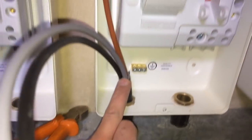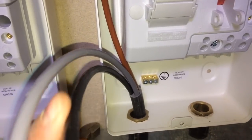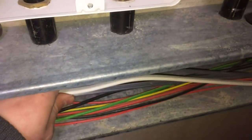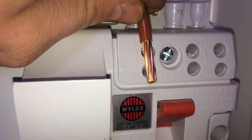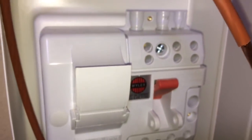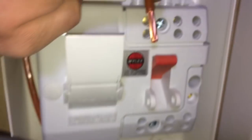The way you do that is just get your stanley knife, ring it round really gently, run it down the cable — obviously shorten it first, you only want to strip as much as you need — and then bring the singles up and in. I've brought my armoured in and stripped it off here. This is a three-core armoured: live, grey being the neutral, black being the earth. You use the black as the earth because you don't want to associate the black with the old colours which is the neutral — you do see mixed wiring on fuse boards. These are 16mm armoured, only a couple of circuits in them — a couple of lighting circuits, smoke alarms, boiler, that sort of thing.